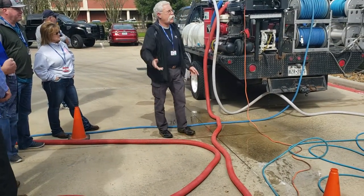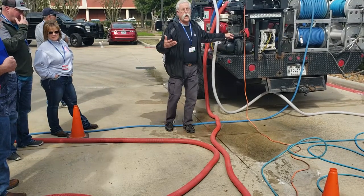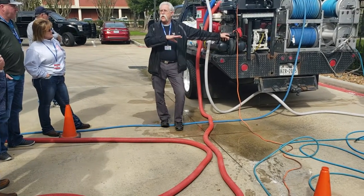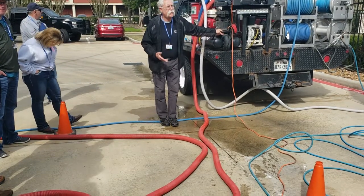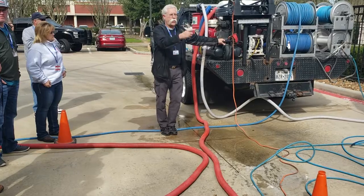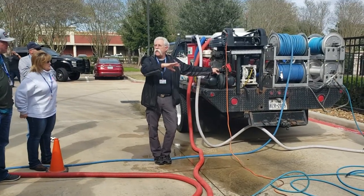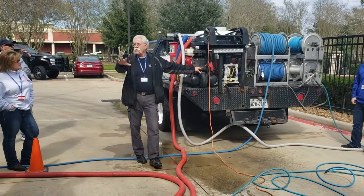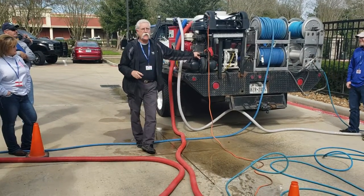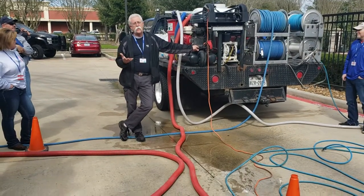If you've got questions about that, you can call the chemical guy or you can call me. I'll be happy to explain how to use chemicals in a manner that won't hurt your equipment, or at least minimize damage, or explain why you have a perpetuating problem with your unloader — it may turn out you're using a chemical that affects it. There's information you need that you won't get in very many places.